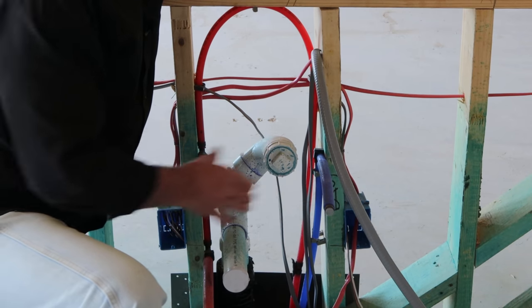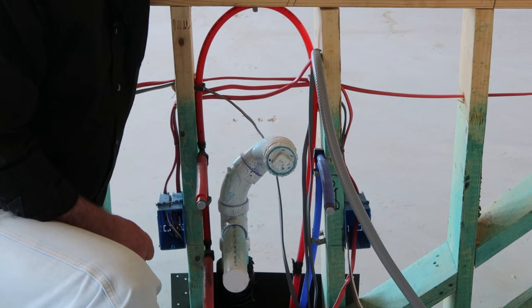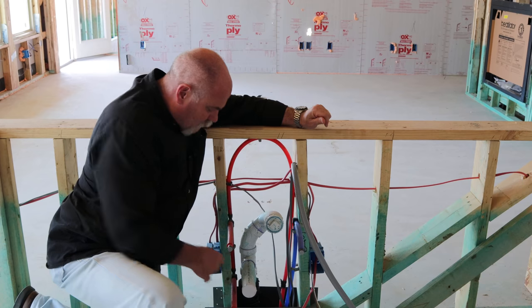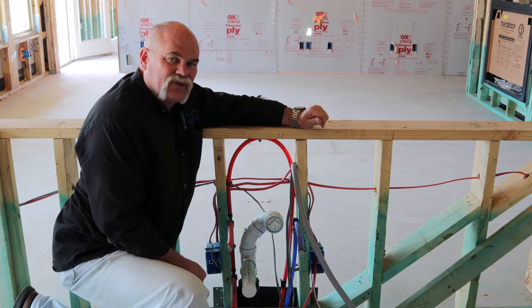As you can see, you've got the cold water here on the right, hot water on the left, and there's a second stub out for hot water. That's for putting in a valve so you can catch the dishwasher on the other side.